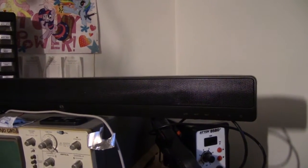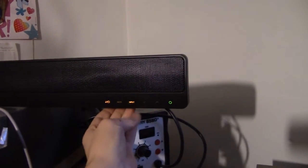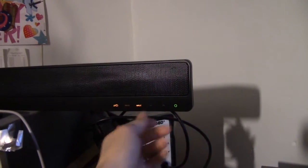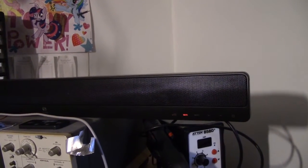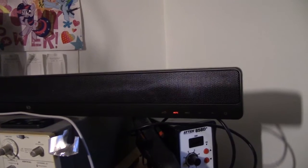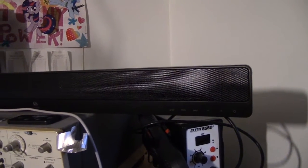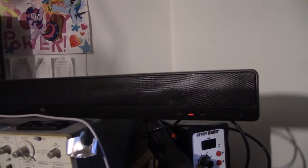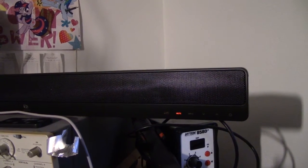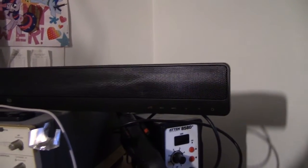And it's been playing alright for 5 or 6 hours now, and all the front panel works, except for the input button. So I'm just going to say that I'm fairly confident, or rather I'm 100% confident that the issue is within the capacitive touch controller chip on the front panel board, and replacing that chip would, with basically 100% certainty, fix the issue, because the entire touch button circuit is just the chip followed by a single resistor and then the piece of PCB that goes underneath the button, which makes up an antenna.